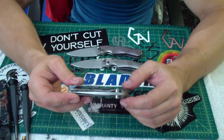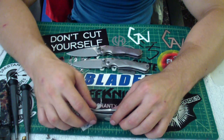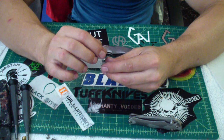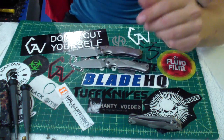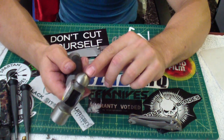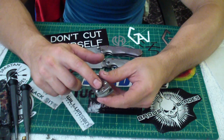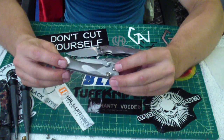The D10, I had some issues, but not really an issue. The ball just fell in, so I pinned it out, like a couple of my friends suggested. When you drill the small hole for a D10, if for some reason it gets too wide because the bit is wobbly or something, and the ball is microscopically too small for the hole, but only by a very little bit, you can take a little hammer with a round end, or a metal rod with a round end, and tap it in. You're gonna compress the material back into the hole, which makes it tighter again, so you can set the D10 again. That's why you drill the D10 hole through, so if that happens, you can push the D10 ball out, correct it, and then set it back in. So that's the first one, number 4.